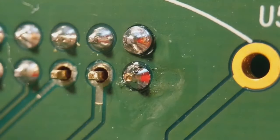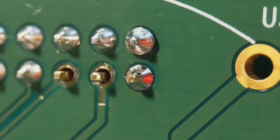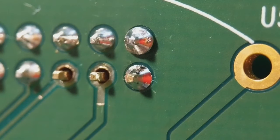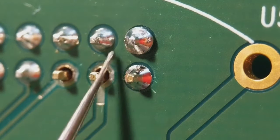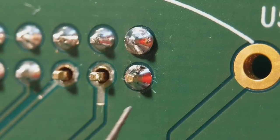Add a little bit more solder so it matches the other joints, plus a tiny bit more flux. This is pretty much an invisible fix — if you need a fix that isn't seen, this is the way to do it. Give that a quick scrub so you can see it clearly. That joint is going to match all the other joints around, with the pad flat to the board. That's a good stable fix. So that's number two.